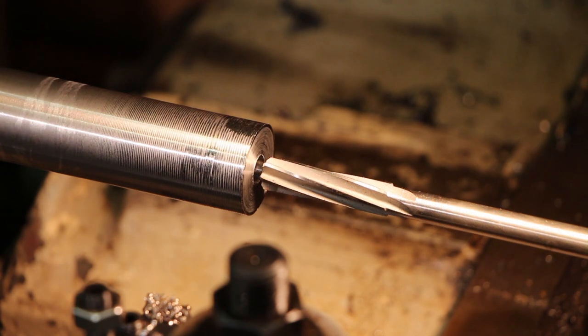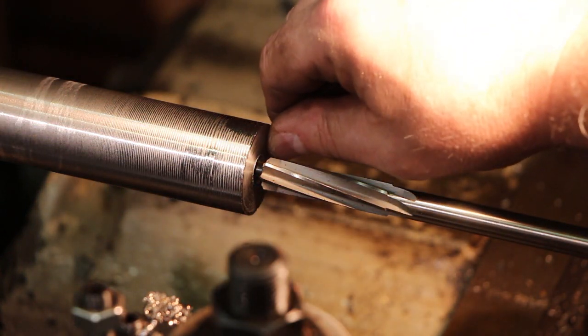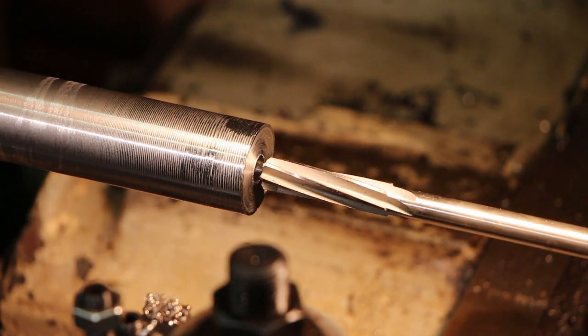Next step here is we want to ream out the top part of this hole to exactly half inch, which is what will slide up onto the arbor sticking out on the actual grinder. So I've measured over there, I need to go 5/8 inch deep with the reamed out half to exactly half inch. And then the rest of the bottom of the hole will be tapped to half inch 20. And that should give us a good shoulder to screw up onto. And then again, it'll seat up flat against this outside edge here.